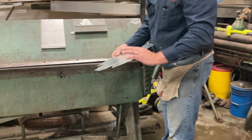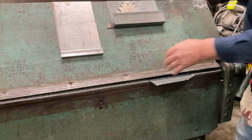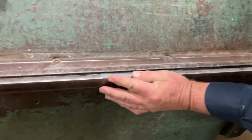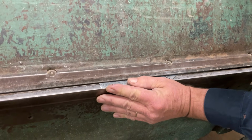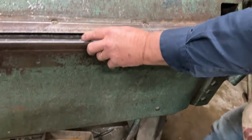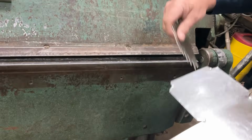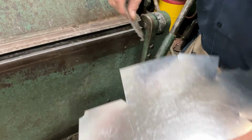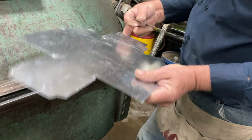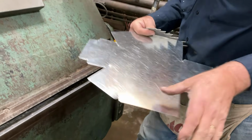These hems are all down. We used all 1/2 inch hems. The front of the brake is a 1/2 inch. This is a 10-foot hand brake. And so one of the things that we have to do here is, let's go ahead and mark all of these 1/2 inch. Marking them on the outside because that's the direction we're going.